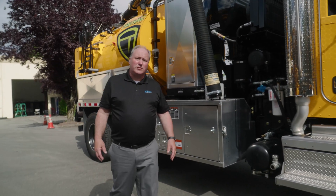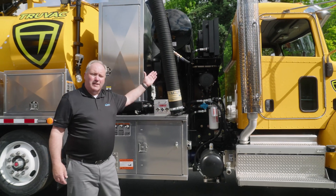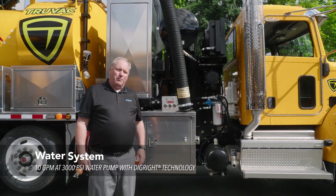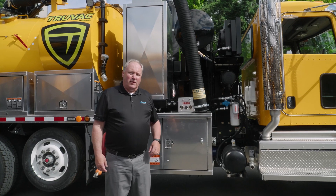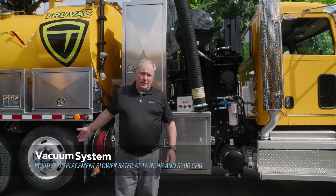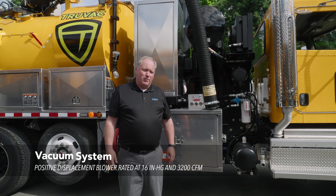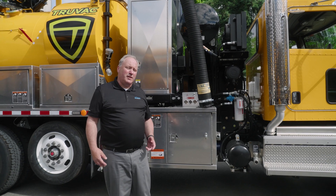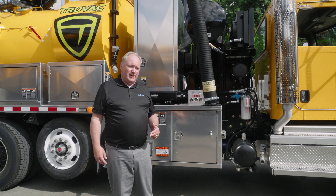The engineering teams can sort things out and make sure your favorite choices of chassis are picked. There are a few things you can see behind me. One is a tall box — that is the boiler. It has a hot water boiler on this truck, and a water system that can go 10 or 20 gallons per minute. It also has an air compressor on this truck — 185 CFM air compressors for doing tools or air digging. This hydro excavation truck is designed specifically for digging.